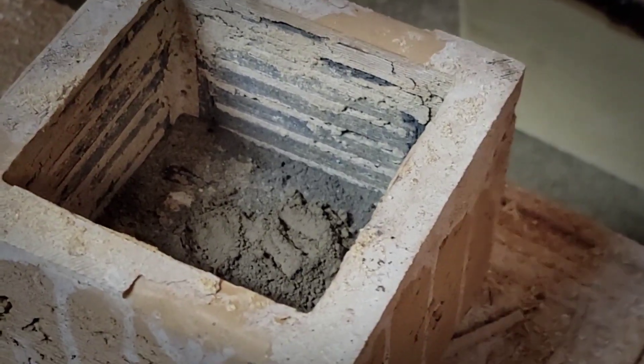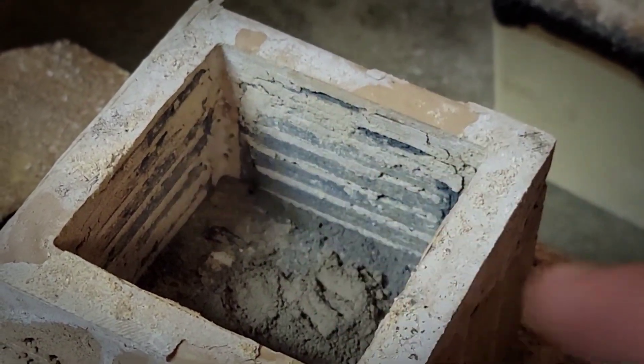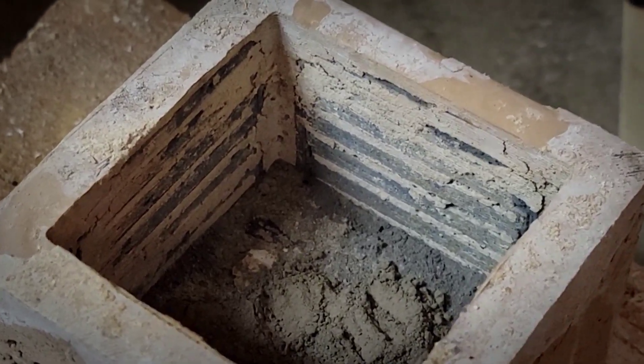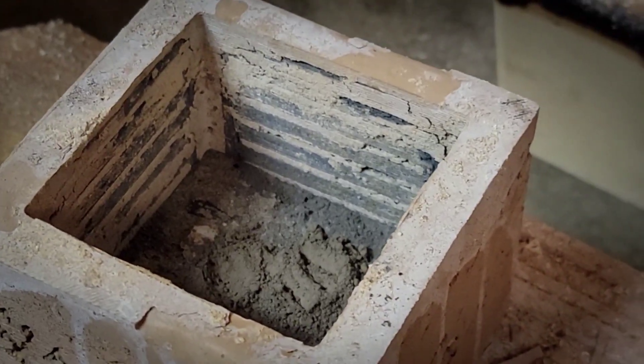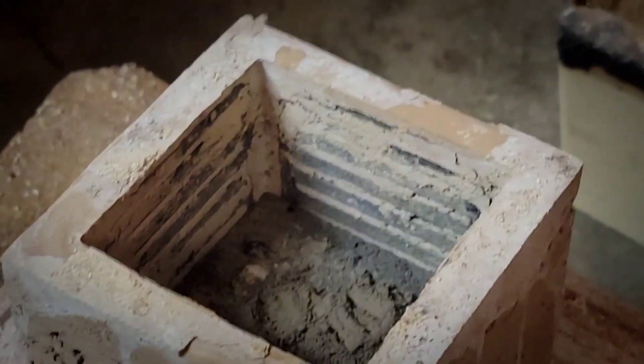Last debound impeller for the night. I have a layer of flux applied on the surface. There may have been a crack when I dropped it in, but I don't think it's going to be too big of a deal. We're going to give this a 30-minute sinter time in the microwave and see what happens.